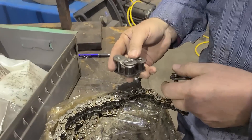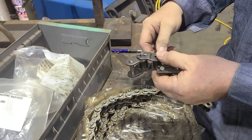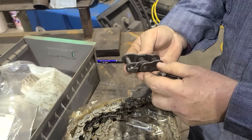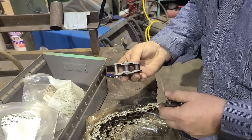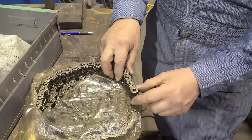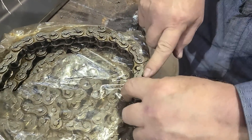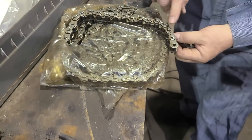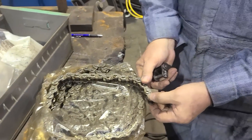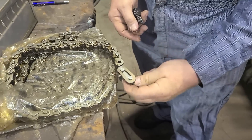You can break the master pin, and that's interesting — I just said that one was the D on that old style chain, but apparently on this half link here they have a D on there too. This is two half links together. A full link would be this piece with two rollers plus the two side pieces. It actually does not include the next roller. A master link has no rollers at all — it's just strictly a master.